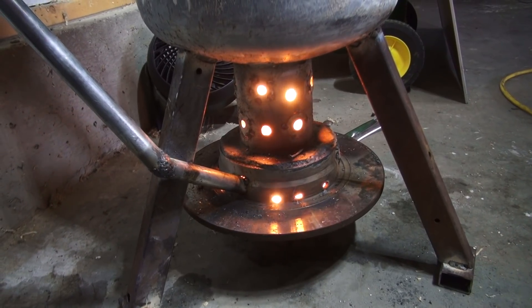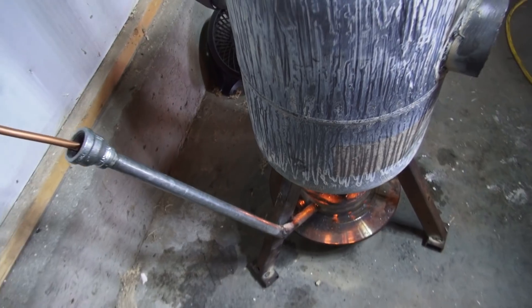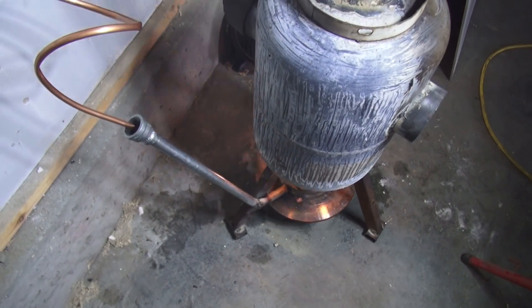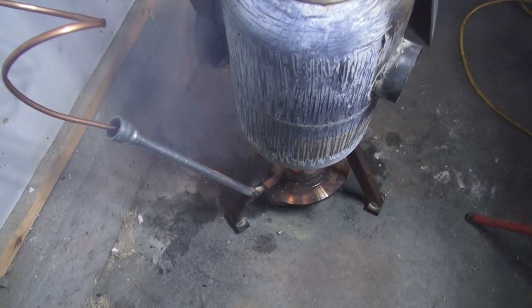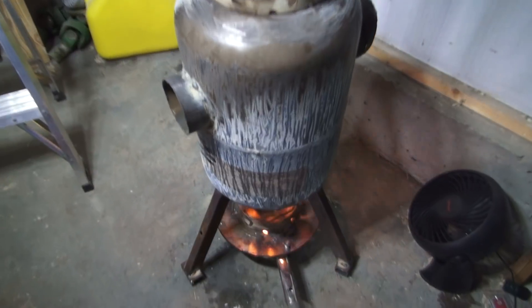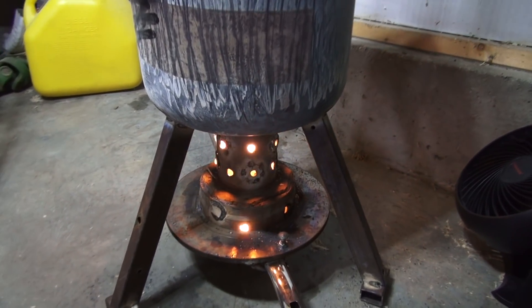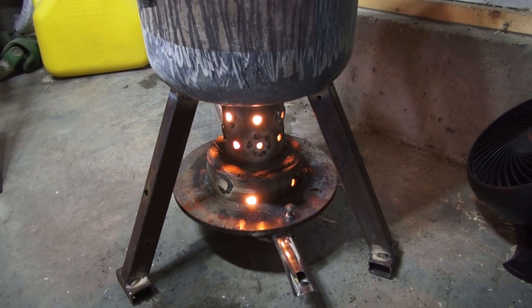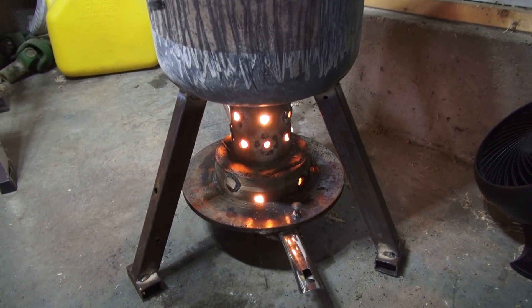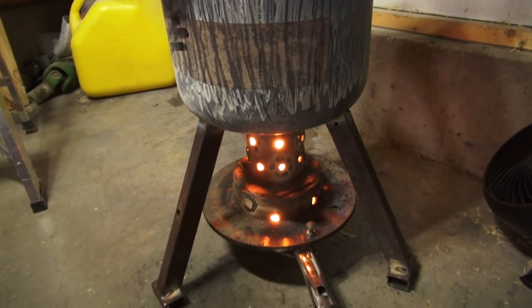On the vessel when I run it at max it will smoke more, so don't add too much oil — when you get that, you know you don't need too much oil and there's nothing to be worried about. Reasons for backfire like that: too much oil, or not enough draft, or not enough air holes. That's never a good thing. And that concludes today's video — thank you very much for watching.